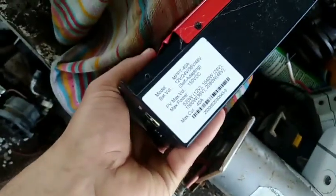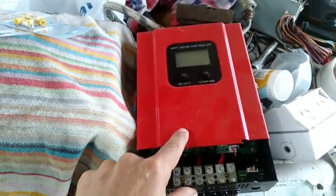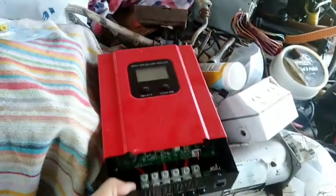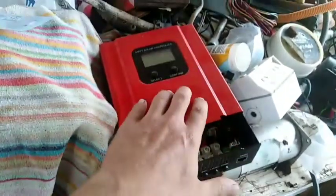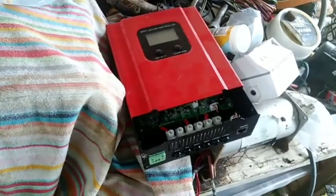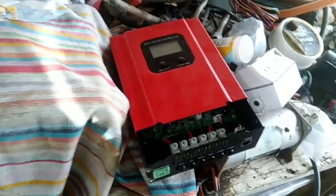That's how you work out how many panels you can wire up. I've got lots of panels around this place — you've basically got to do separate circuits with separate charge controllers. This will be my fourth charge controller. I've got three running at the moment and I'm adding this one, all putting 24 volts out. You can use other charge controllers that handle more panels, but then you've also got the problem of mix-matching panels, which I am.